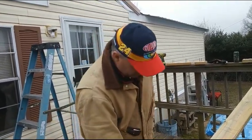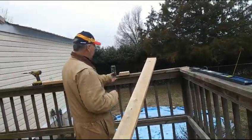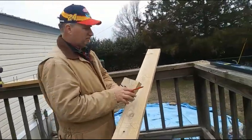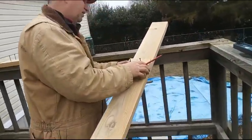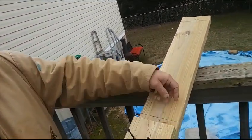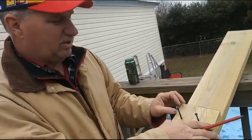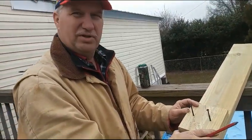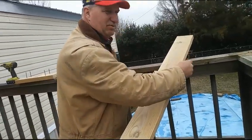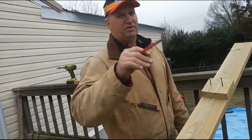This has all been done. Now, instead of just relying on the screws, I'm going to take these boards — which we pre-drilled so they wouldn't split — and put them up against the wall so we can put the 2x6 up against that and screw in, putting a couple at an angle, maybe three at an angle. That gives a lot of screws into it to hold it in place, and it's cleaner than having a bracket down here.